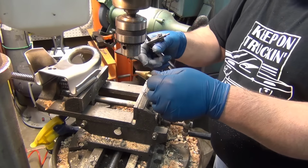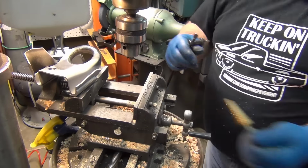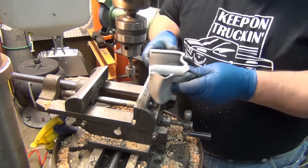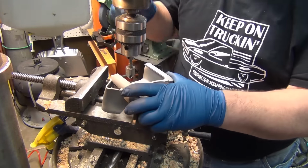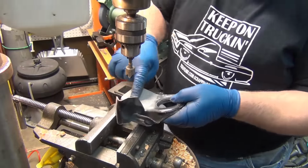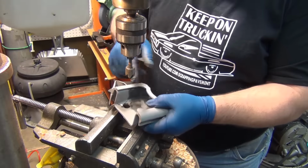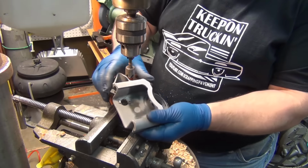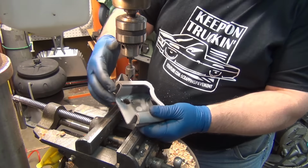And I'm sure that is just a cheap Harbor Freight unibit. And yeah, I don't necessarily want it out that far normally, but I also don't want to hit the edge on the chuck there. The top gets deburred by the next step on the unibit. It's just the bottom side you have to deal with. And there wouldn't be near as much if it hadn't been for the fact that the metal is almost the same thickness as the step.